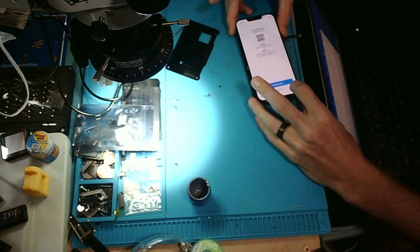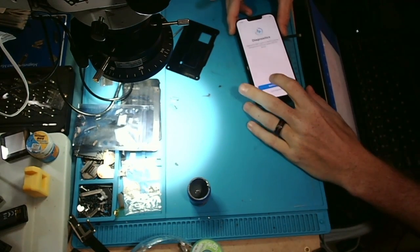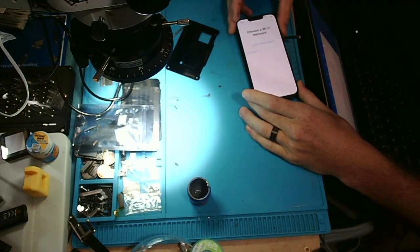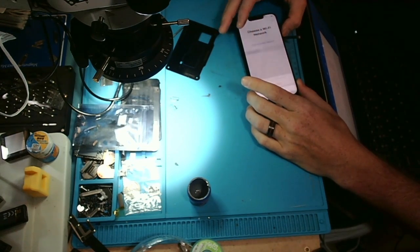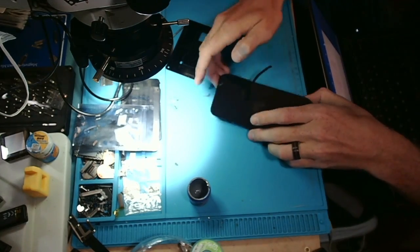So now we're going to see, I get IMEI. That's good. That tells me that the baseband is working, right? So good, that part of the Reball worked. Now we're gonna wait for Wi-Fi. This is the most important part. Watch it not work. Oh my goodness, what a fail of a video this would be. I don't have any of the antennas plugged in, so that, come on. Come on. Don't make me plug in the damn antennas. That would be so dumb.